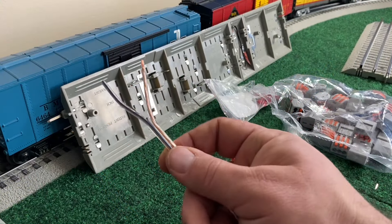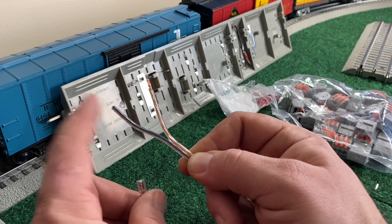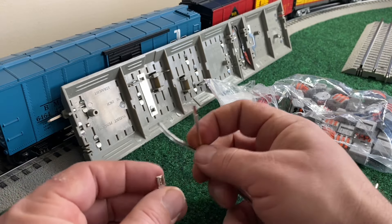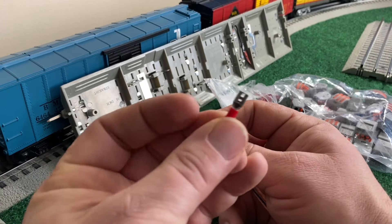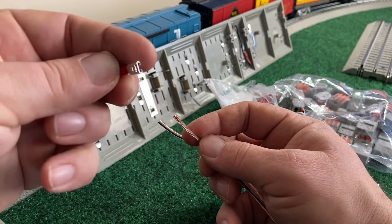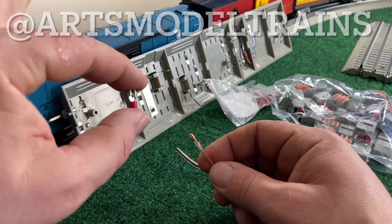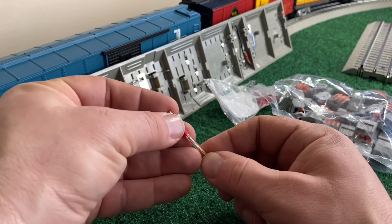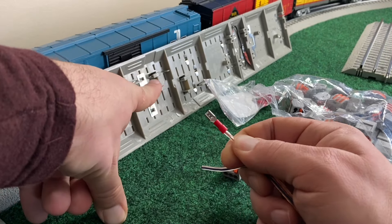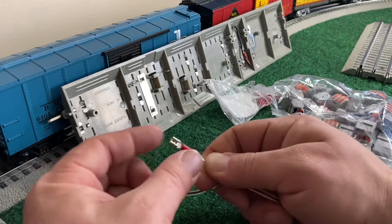Our O-gauge railway now has 50 feet of speaker wire underneath it. This blue-marked wire I used for all of the common or outer rail connections. Then this clear one got used for the middle or positive connections on all the tracks. These are connected to the tracks by these little connectors — I forget the technical name, but my friend Art's Model Trains helped me find all of these neat pieces. Links are down in the description. These are super helpful because they go onto the end of the wire and then connect to the terminal posts on the bottom section of most large pieces of Fast Track. They just clip on, and if you need to make a change, they just clip off too.